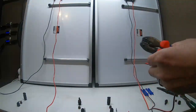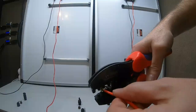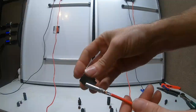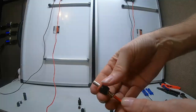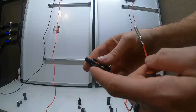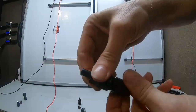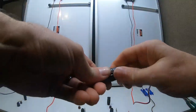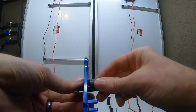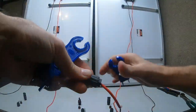Take that twisted wire and pop it into your Bouge RV crimper, and give it a crimp. Then you take a cap, a water seal, and then the MC4. These are confusing because there's a male-looking thing with a female inside — that's just how it is. This goes in there, and then to tighten it you can do that with your hand, but Bouge RV sells these little wrench tools. Put one on each side and click until you hear one click — done. That cable is complete.